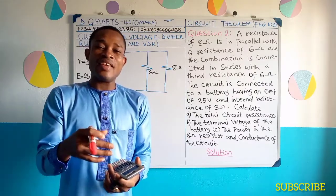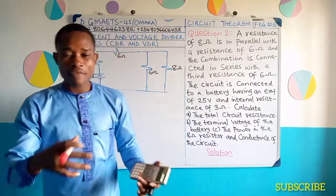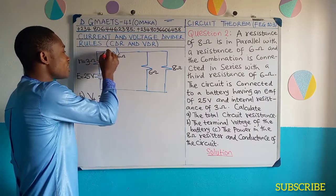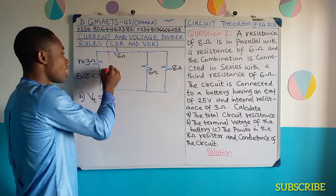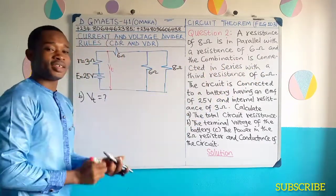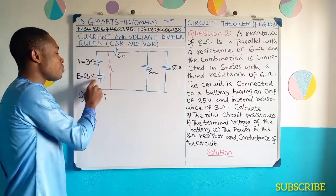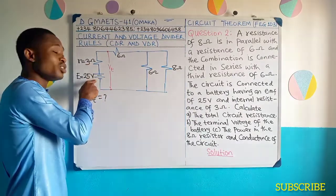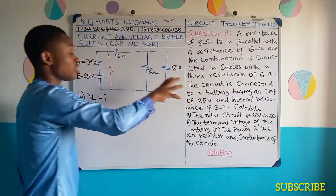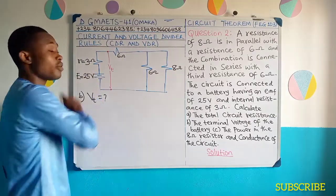The chemicals of the cell, which continue to react, reduce the efficiency of that cell. Instead of rating 100%, which is that 1.5 volts, it will have a value less than that. So the terminal potential difference — the terminal voltage — if I mark off these points, we have V-terminal: the voltage from here onward. Because this 25 volts will definitely be reduced once current is delivered by the cell — this internal resistance will cause a potential drop. So the voltage reaching the external resistance here will be less than the total electromotive force, and the reason is due to the internal resistance of the cell.